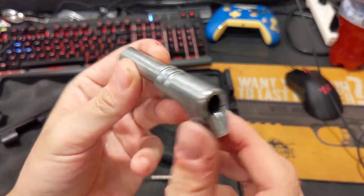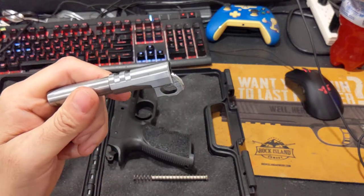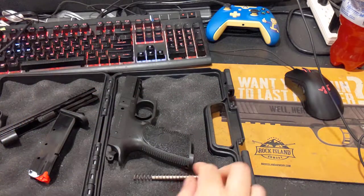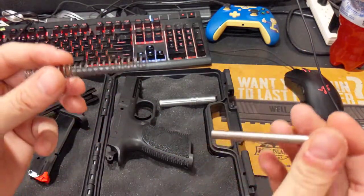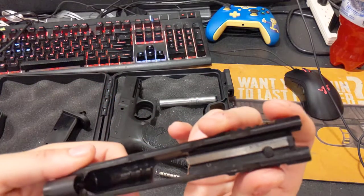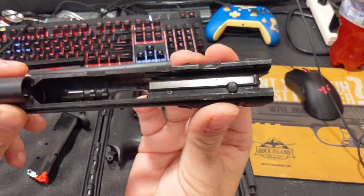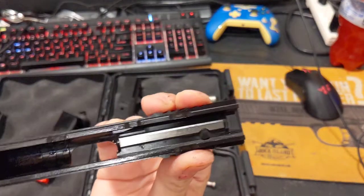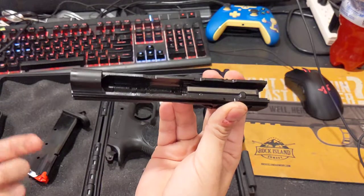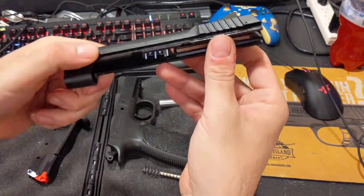It has a ramped barrel for nine millimeter — a forged chrome-moly barrel with a cam-style locking setup rather than a swinging-link setup. It has a metal guide rod, though it is not captive. Inside the barrel almost looks 1911-ish or Browning Hi-Power-ish. It does have a drop safety for extra peace of mind, especially if you carry in double-action with no safety engaged. It uses the inverted rail system of the CZ 75 family.